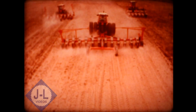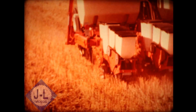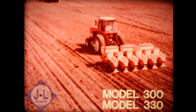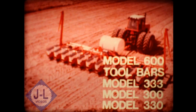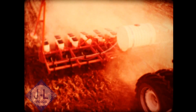Presenting the most complete line of all-tillage planters to match any tillage practice — conventional, minimum tillage, no tillage, or double cropping. Ideal for conventional planting: the two-bar pull-type model 330, the two-bar mounted model 300, the three-bar pull-type model 333 with folding and non-folding toolbars and four to 12 row capabilities, and the eight or 12 row model 600, a big three-bar pull-type folding frame. Add the patented Allis-Chalmers no-till coulters and move to minimum tillage planting with the model 600 folding frame, model 300, or model 333.